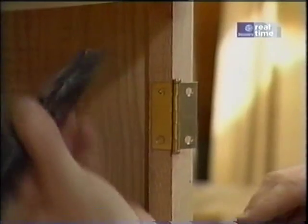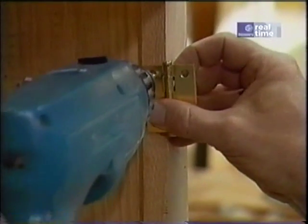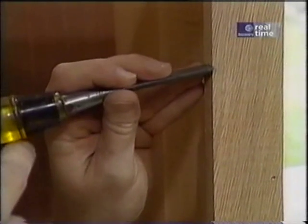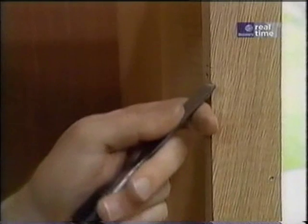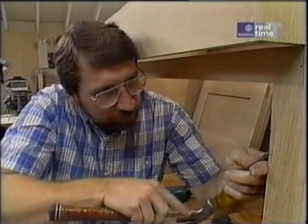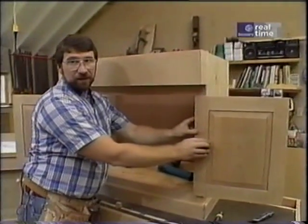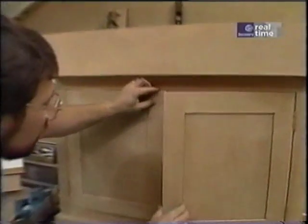Then I'll take a sharp utility knife and trace the outline of the hinge, then take it out. And then just using a chisel I'll remove the right amount of material. Boy, is this oak hard — it takes a good sharp chisel. That fits pretty good — three more to go. Even though this hinge is just surface mounted to the door, I don't think I'll have any problems because it's light enough. The hinge is nice though because it allows the door to open 180 degrees. Now what we ought to do is just check the fit between the two doors — I think that looks pretty good. Now we're ready to start working on the top.